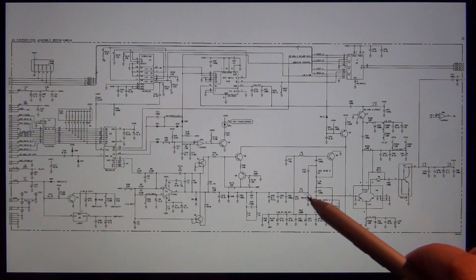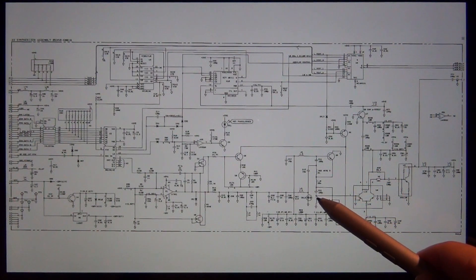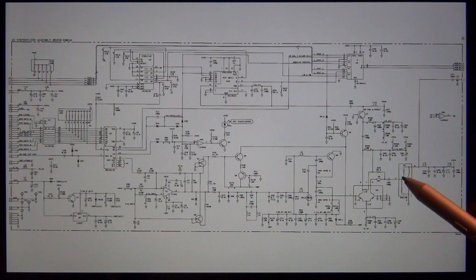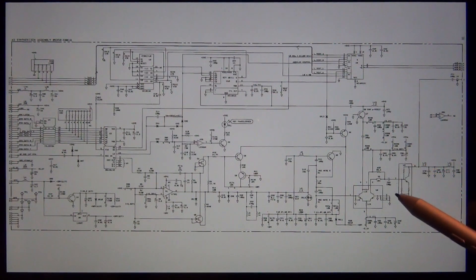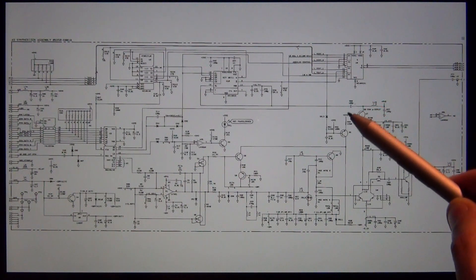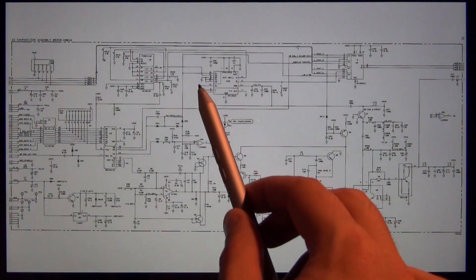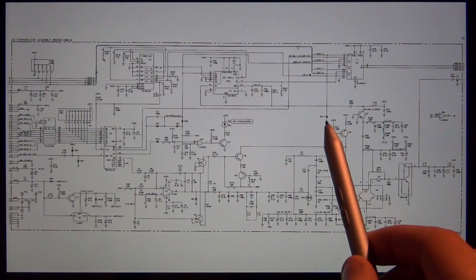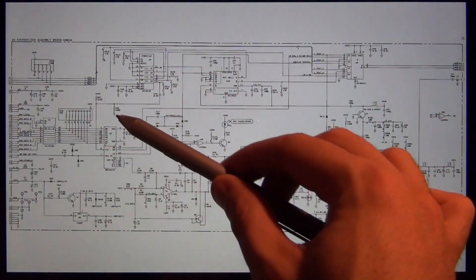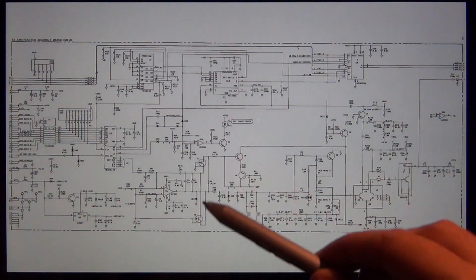It says 'no IF latch', which at this moment makes sense because there is no IF — the RF port at the bottom is not connected to anything. I'm going to turn it back off because remember this thing is supposed to put out 14 dBm — you don't want to disconnect the LO signal while it's putting out 14 dBm. You don't want to remove the load from one of these things while it's running. Let me find which of these cables is the LO output. So let's disconnect that. Alright, that's the LO signal coming out. Now I just have to find an SMC connector from my mystery box of connectors. This is a male SMC connector. I have an SMA cable coming from the Tektronix MDO — I'm going to connect this to there.